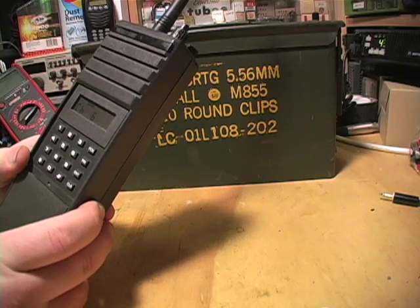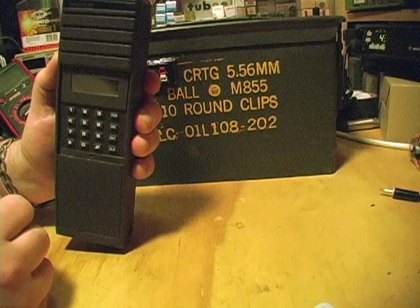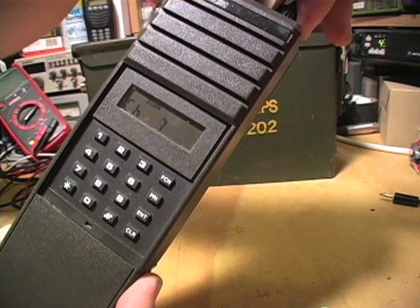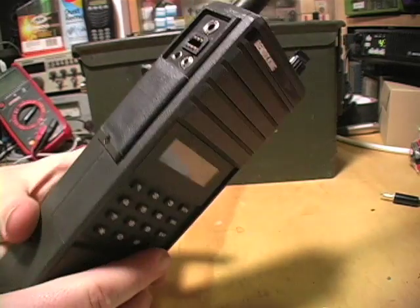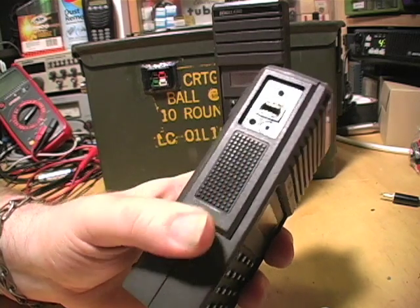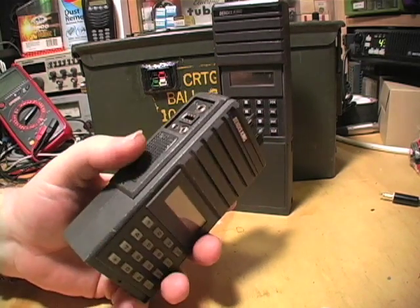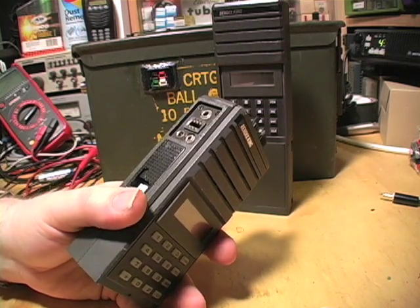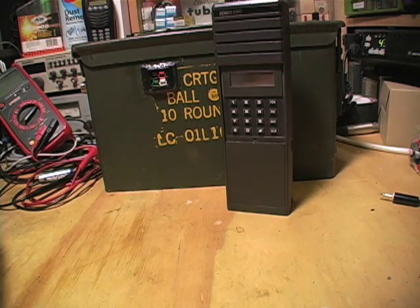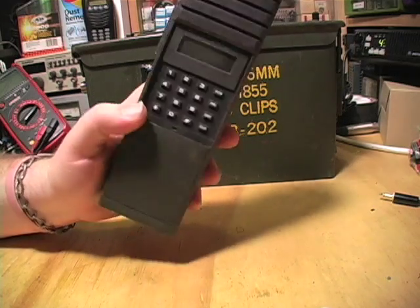They usually have some issues with them, but as far as the actual radio's transmitting and receive capabilities, they're pretty amazing. One of the issues is there's really no display — it just says channel 5, channel 6, channel 7. There's no alphanumeric. These little transmit keypads fall apart pretty easily. The good thing is with the repeater we're building here, you don't need to push the talk button, you do not need a display. The stuff that normally fails and is a shortcoming of these radios doesn't matter. The circuitry inside is wonderful — they transmit and receive almost magically as far as HTs go.